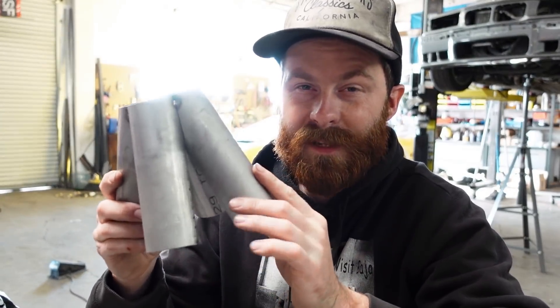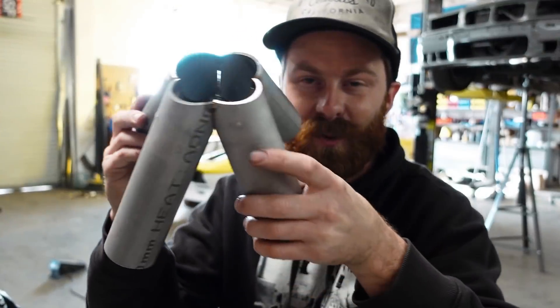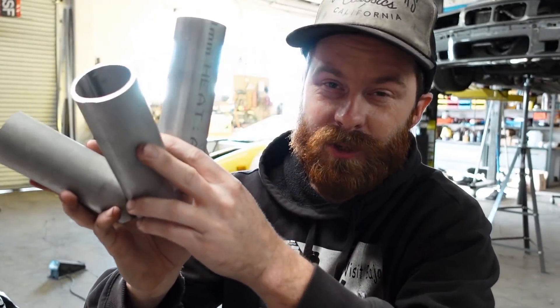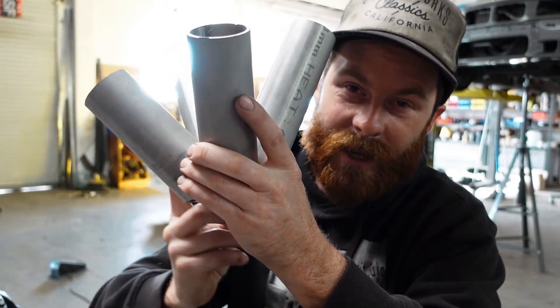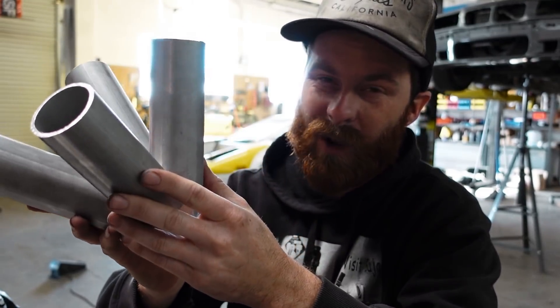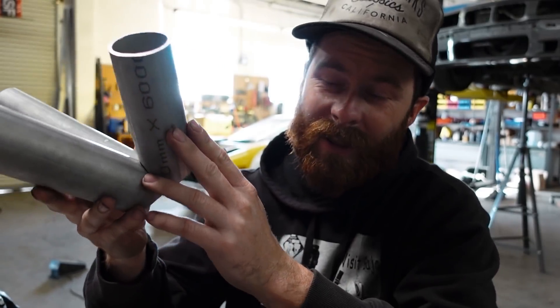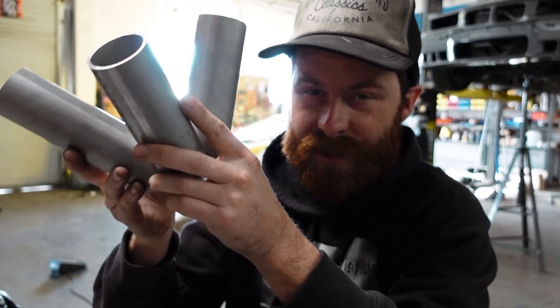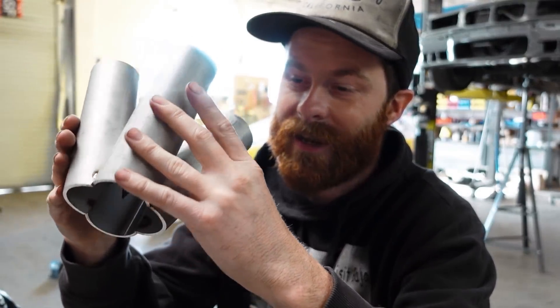The final result of what we just made is this — except it's not. This is the second time through. The one you just watched me make is this one, and I was unhappy with it. The angle between the tubes is way too far apart. I wanted to make sure I could get in and weld the gaps, but overall this is just way too spread out — it's not going to flow the way I want. So instead of a 60-degree angle, we changed it to a 72.5-degree.